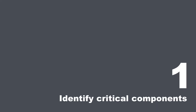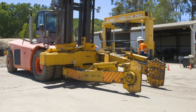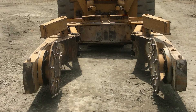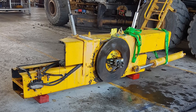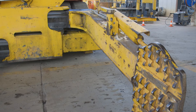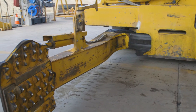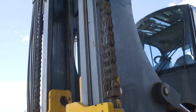You need to identify the critical components of each type of tyre handler on your site. The most critical components include two-piece arm joints, for example those built into some JEC handlers; slew rings used on most CWA, IMAC and IMT tyre handlers; pad rotation pins and connectors, which are used on all tyre handlers; and the chains used on forklift tyre handlers.